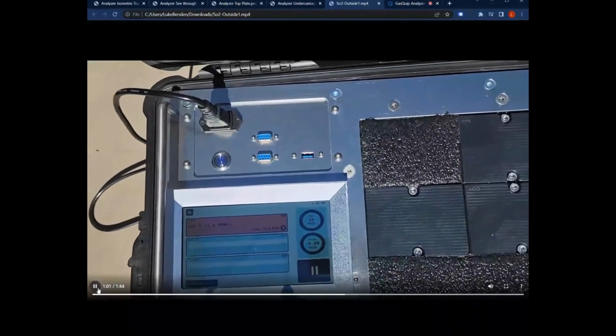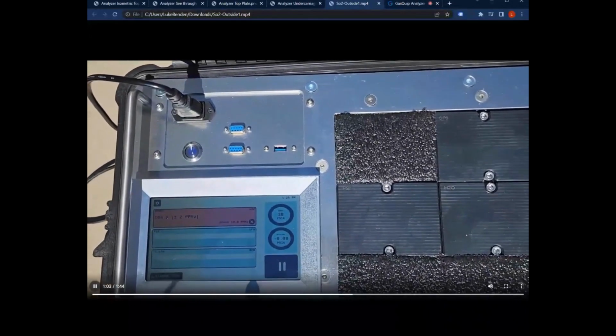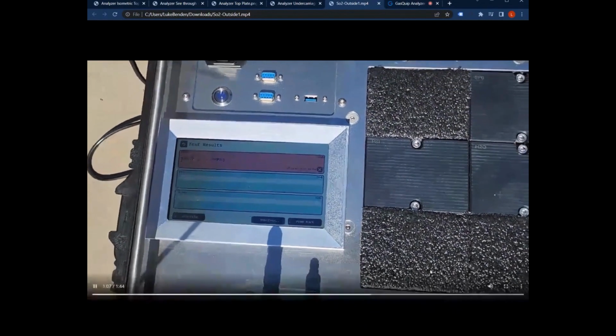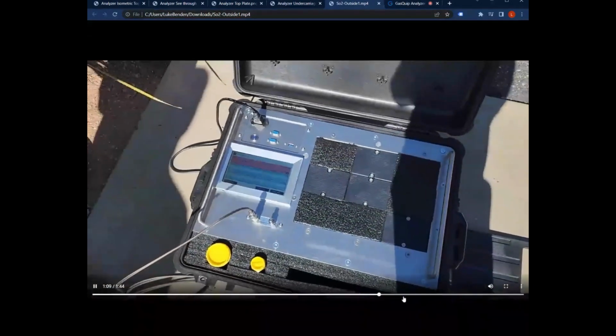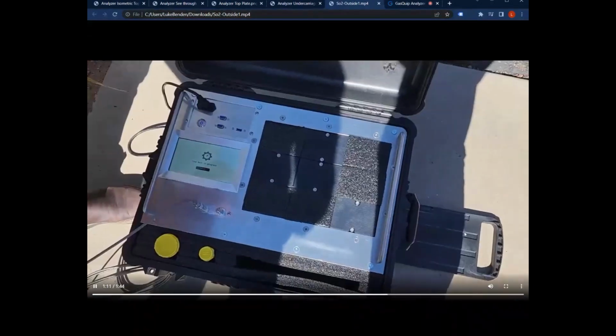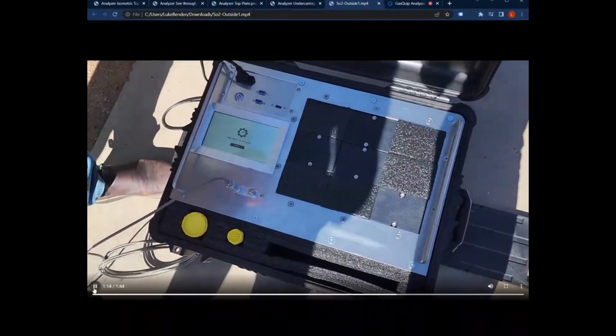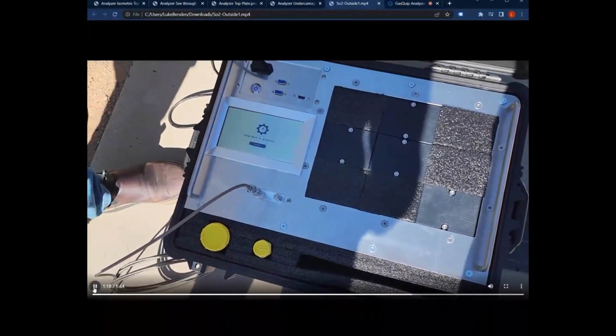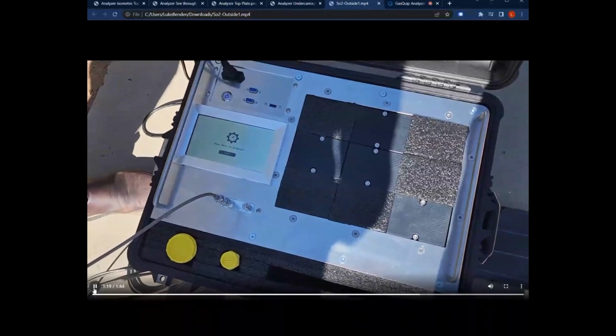But for this specific test, the device finishes the test and shows the results page. Like I said, because the SO2 level is higher than the threshold, it goes ahead and stops the test. But once the test is done, we can pump back the gas. You'll see that pump back in progress, and you'll get a confirmation once that pump back is complete.